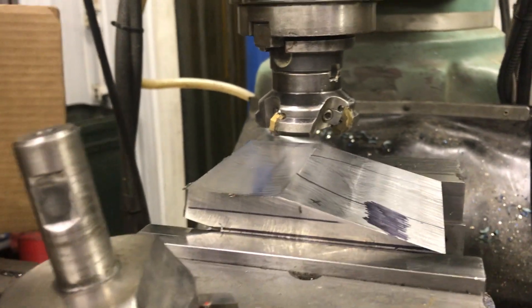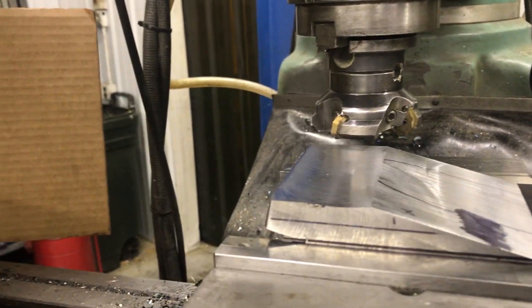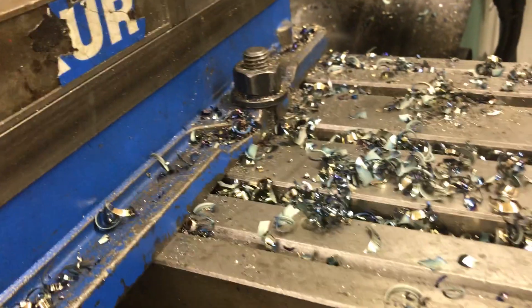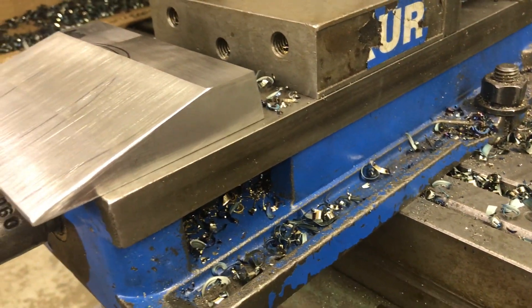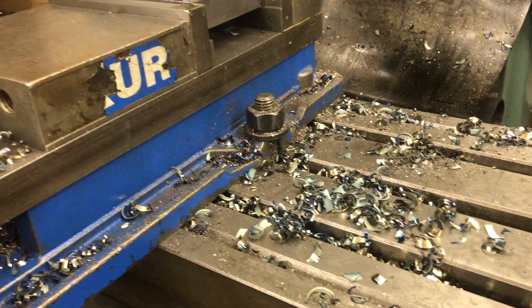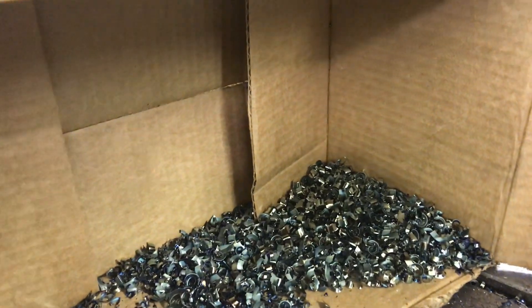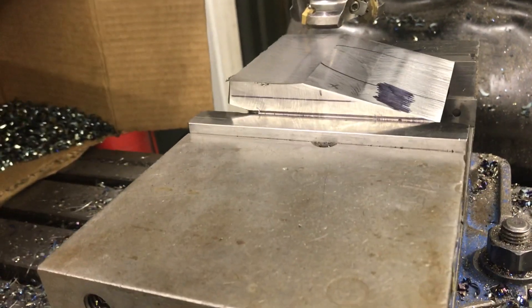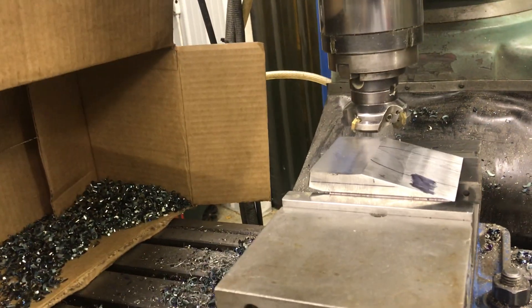This is S7 tool steel and I'm taking a hundred and fifty thousandths depth of cut. You can see by the chips on the table that they get pretty hot. With the inserts we've got today, the heat is supposed to be going into the chip. I've got a box full of chips here — they probably get between seven and eight hundred degrees when they turn blue, so you don't want them landing on your arm. I'm going to go ahead and take a cut here so you'll be able to see what's going on.